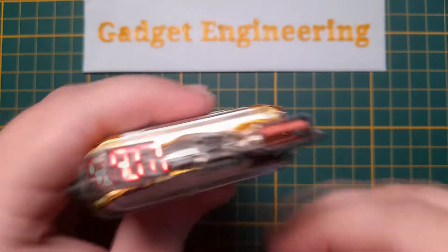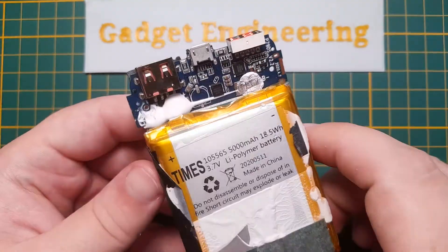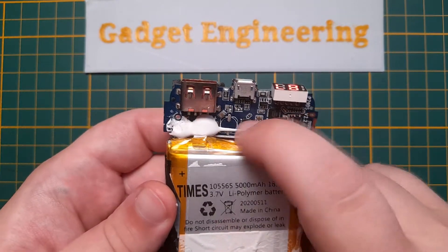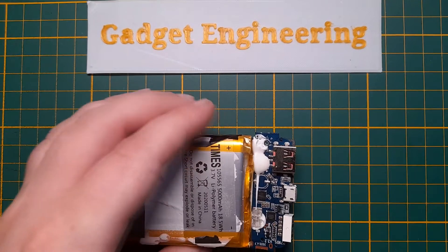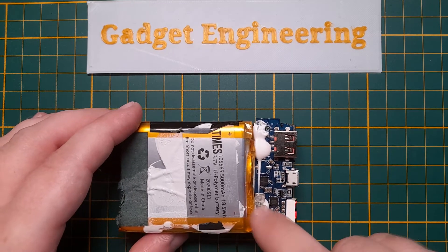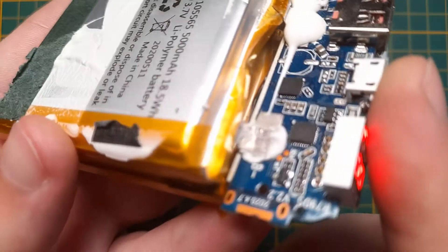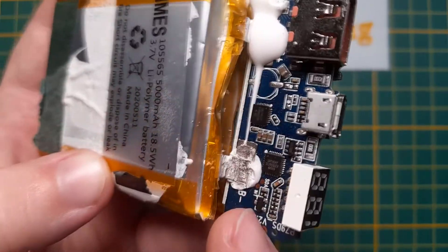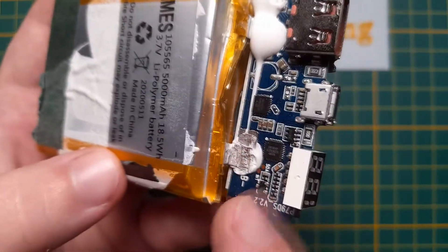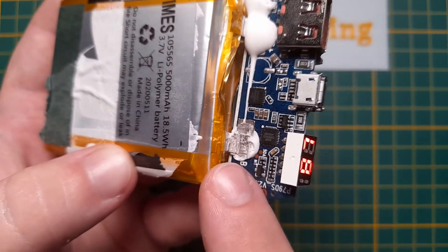Back to my issue: the display was just flashing on and off with no way to reset it. I unpacked the system from its plastic shell and picked away the silicone on one of these contact pads — minus and plus coming out of the battery. I first thought of unsoldering the two connection ribbons to the battery to take away power from the board and reset the microprocessor. Unfortunately, these pads seem to be point-welded on, so ripping them off would be difficult and would probably damage the battery or pull up some tracks. Also, these ribbons coming out of the battery are often steel, so they won't take any solder.